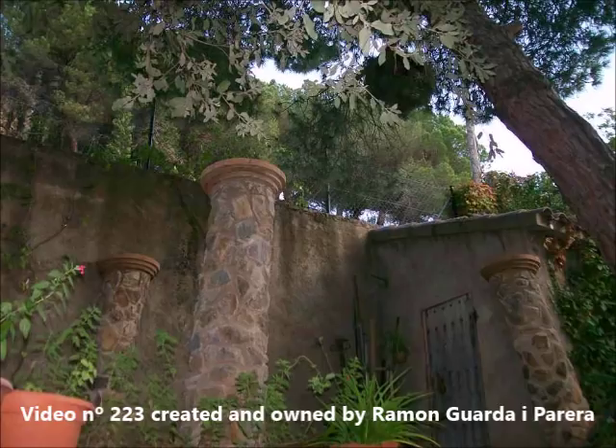The columns are finished and ready to make the arcs that will frame the vault. In the side walls it is not necessary to make furrows so that the fine bricks, which will form the vault, enter them. It is enough that these are delivered to the side walls without any support. In this vault model the effort is only transmitted to the angles and, therefore, it is called a four-point vault.